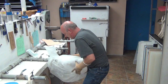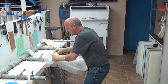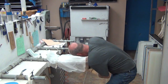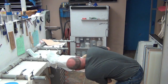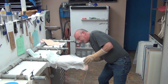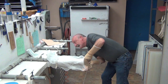The guys put the bag in the foam and then line it up — they're better at this than me. I don't do a lot of fabrication; I have six technicians and they don't let me. On the weekends I get to do whatever I want. I'm opening my vacuum and stretching as it comes down, trying to get all of the wrinkles out before the vacuum hits. You can stretch your bag to work out wrinkles before it's sealed. If you've got a wrinkle, shut off your vacuum, work it, and reopen it.